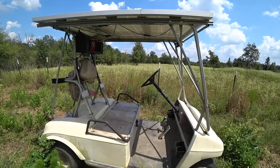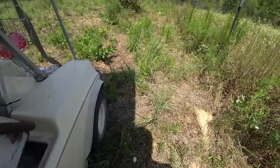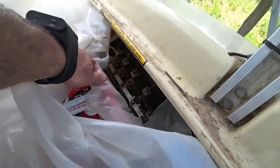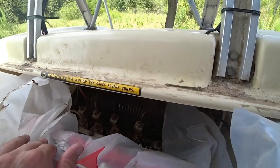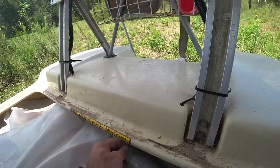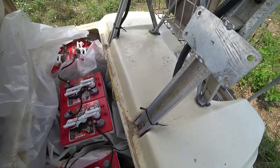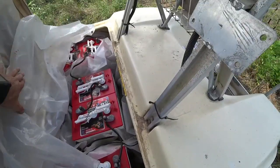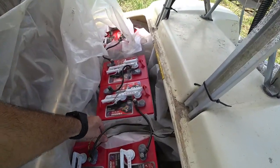This is an antique — like I said, it's a 36-volt cart with six 6-volt golf cart batteries. There's an old solenoid resistor setup, no power controller or any of that modern stuff. The plastic helps keep the dust off the top of the batteries, provided you make sure the batteries can still ventilate. The panels are wired in series, and having a 36-volt controller is great — all you have to do is put the positive on the most positive terminal and the negative on the most negative.